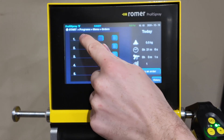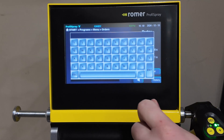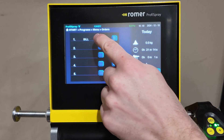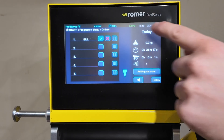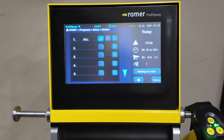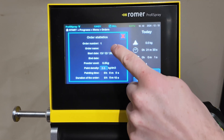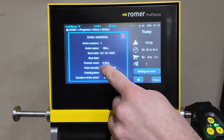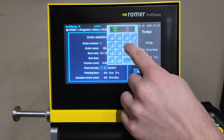With orders, you can track how long your job takes as well as powder usage. You type the name of the job itself, and when you hit the check mark, it starts the job — you can see it at the top of the page. It'll start a timer for how long the job has been going, your trigger time of how long the spray gun has been on, as well as presses of the spray gun. You can tap on the right to check the stats of your job, and if you need to adjust the powder usage, you can go to the specific gravity on the TDS and type the number in to properly track how much powder is being used.